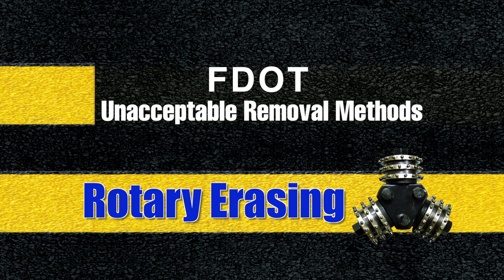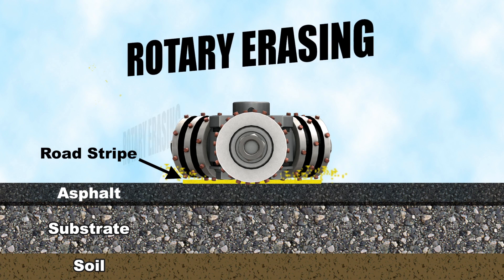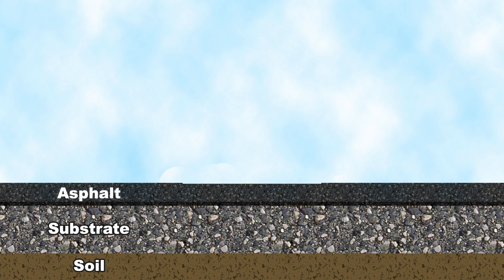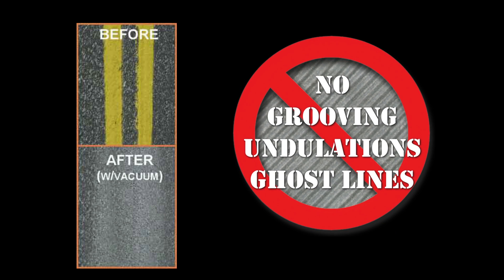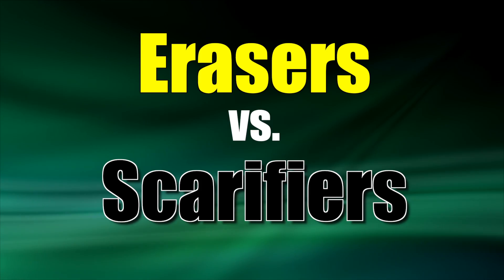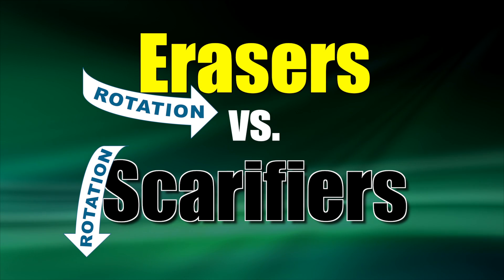This brings us to the purpose of this presentation: to distinguish between the scarifier machines and the rotary eraser machines. A rotary eraser is a removal machine containing a rotary disk with cutters that spin horizontally, using a scraping and breaking action to remove pavement markings, leaving a bevel-edge, no-groove surface finish. Where a scarifier leaves a sharp vertical mark, the rotary eraser, like the water blaster, uses the same rotary action to leave a soft, bevel-edge finish that does not allow water to collect. Contractors who bring these machines to the job are not permitted to use them because the engineer has not been provided with enough clear information that there is a difference between erasers and scarifiers. It is important to understand that it's the rotation, and not the machine, that causes road scarring and grooving.